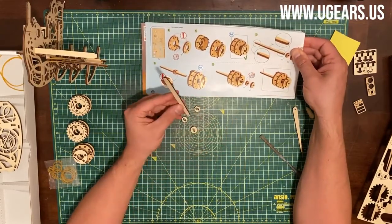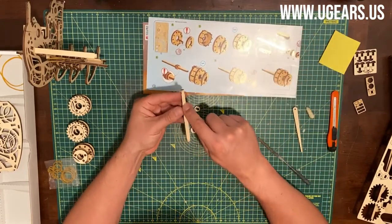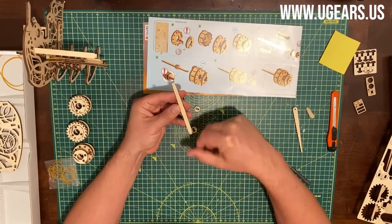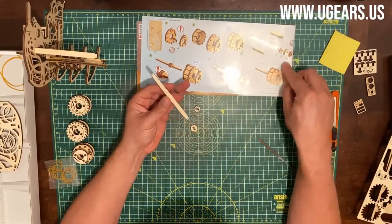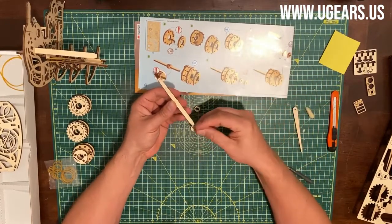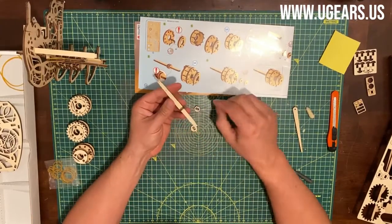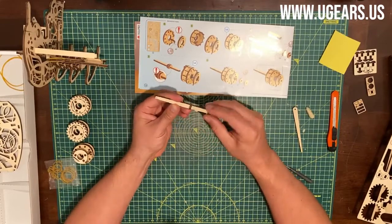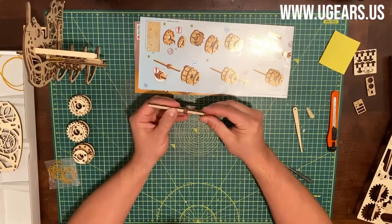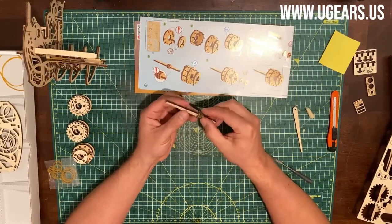So 50, these little two dots or slashes facing away from you. There's a little step and short piece closer to you, and that's the side you're inserting the 51s and 52s from. Now, that little step on here facing counterclockwise direction, and you push it all the way in, as far as it can go, almost to the center there. 52 and then 51 once again with the same little step or tooth facing counterclockwise direction.